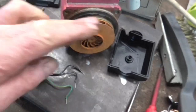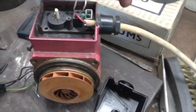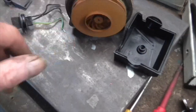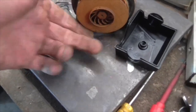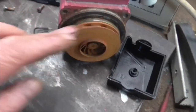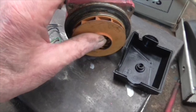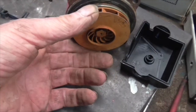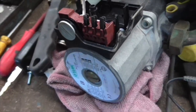Well here we are folks. There's nothing in the pump and it spins freely, but it doesn't start. When I turn the power on it's not running - it actually magnetically locks. So I think what we have here is a knackered pump. And I think the noise may have been, unfortunately, just the pump jamming. There is quite a lot of play on that rotor there - it could just be worn out. Replacement pump.